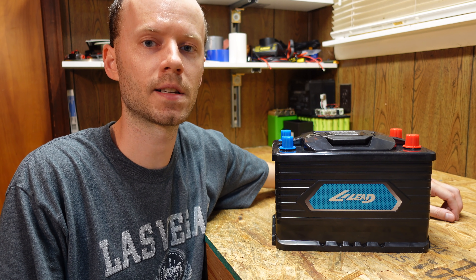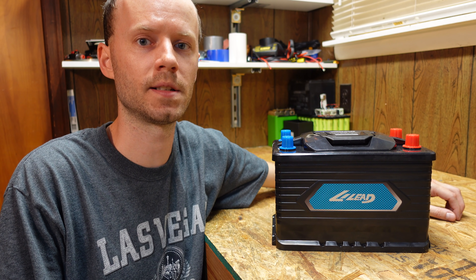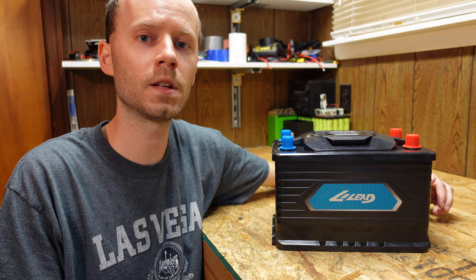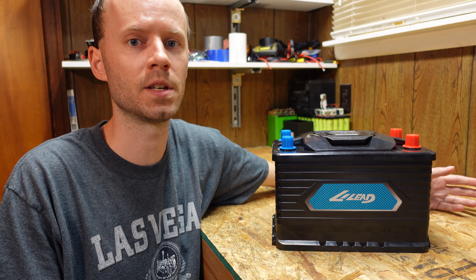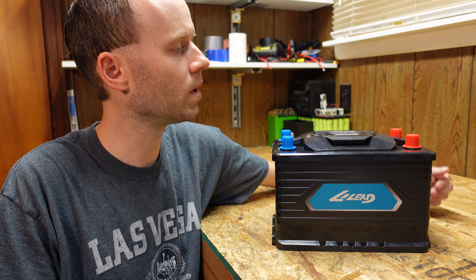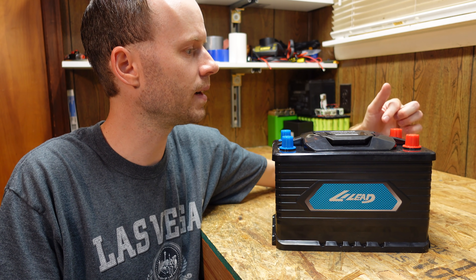Because it's not shipping damage, I'm going to go ahead and review this battery as-is. This battery is advertised as a starting battery, particularly for marine use, though it can be used pretty much anywhere as a standard lithium iron phosphate 12 volt battery. What makes this battery a little unique compared to others I've reviewed is that it has a very high surge rating of up to 800 amps for starting engines.